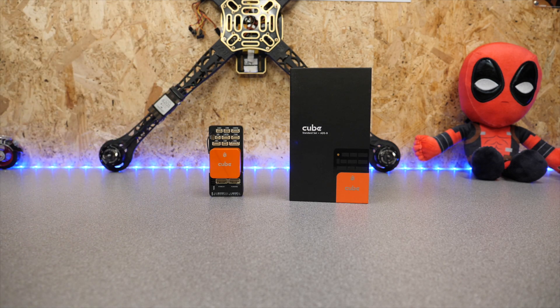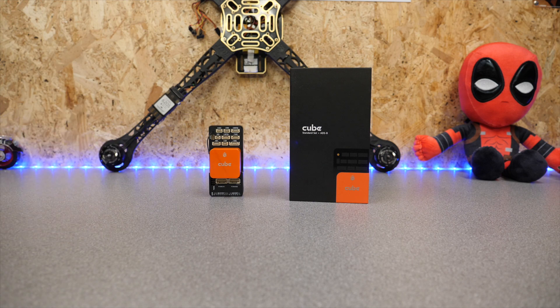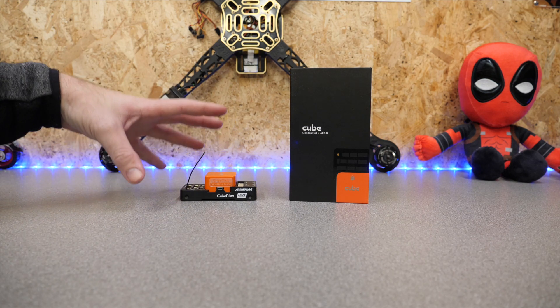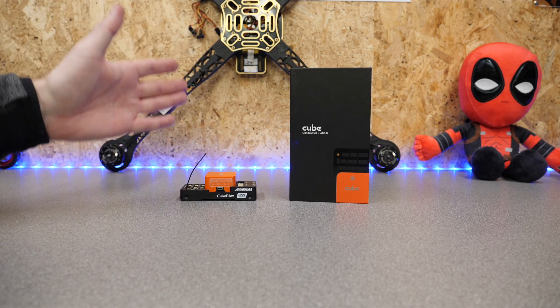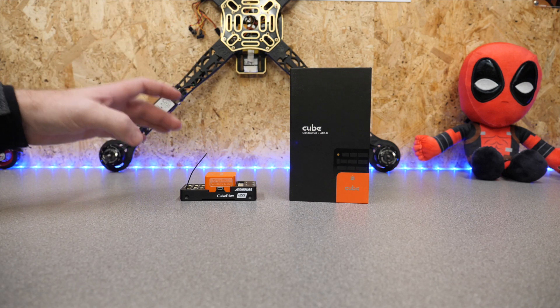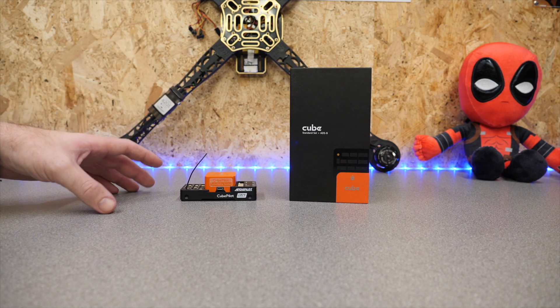In this video I'm just going to take you through what the situation is on doing that with this board. This carrier board has its own antenna built in for the ADS-B and it is that little bit of wire there. There is externally no antenna port on this for plugging in an external antenna. However, there is a silk screen on the board for a UFL connector where you could either directly wire this up or solder on a connector yourself.